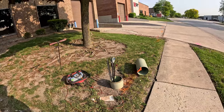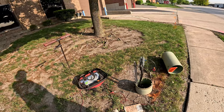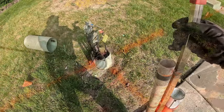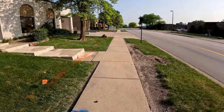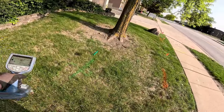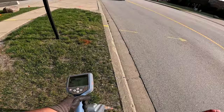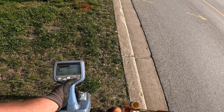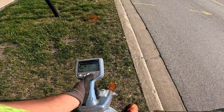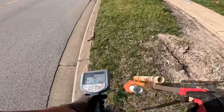Wake up all the bees — any bees in this pad? Alright, you see I got another drop in this pad. We'll figure out where the strap goes. See how far I am — 65 feet away. I'm going to do my sweep. Notice my gain glow on the receiver is 57% and I got a tone right by the curb. I'll bump it up a little bit — I want the peak bar right in the middle. 10 milliamps, 2 feet. Good null response — this is my cable — and I'm going to mark out for my bend.